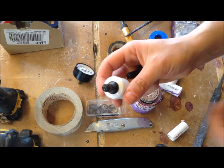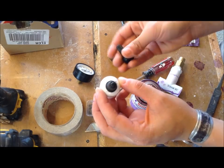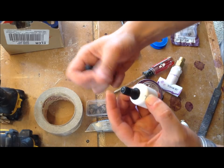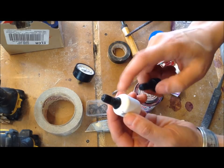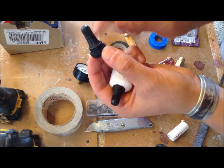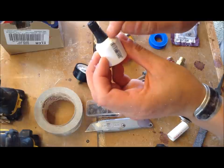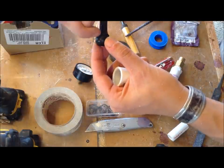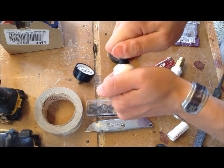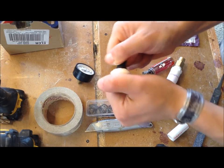That valve in there, my hole didn't turn out as centered as I thought it was going to be, but just elongating that half inch hole a little bit with that Dremel really worked, and you'll know it's seated in there properly when this rim right there starts to stick out the hole right there, and that means that that PVC is wrapped around this lip and it's not going to go back in or come out.